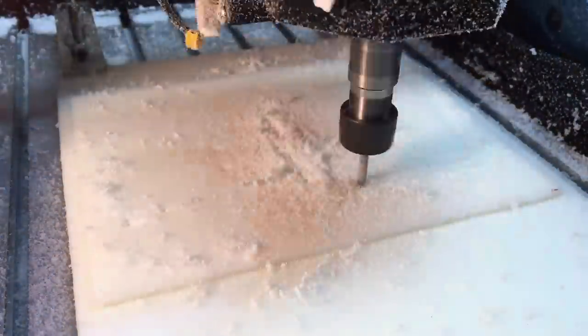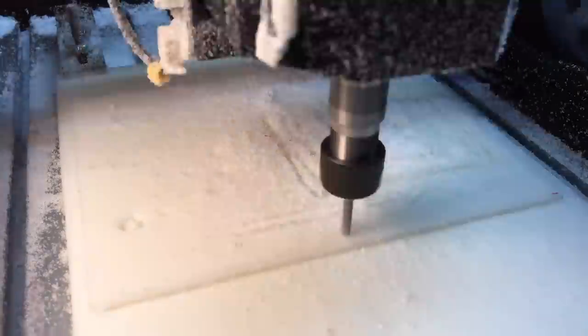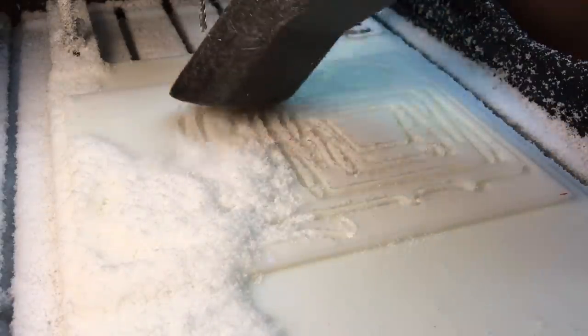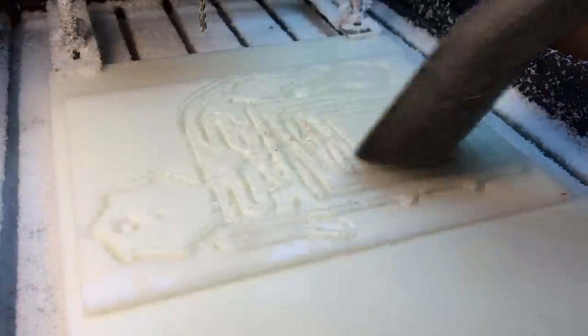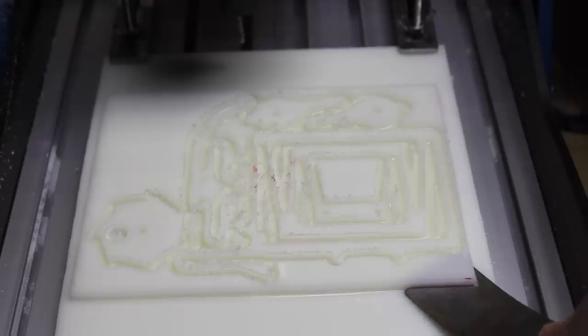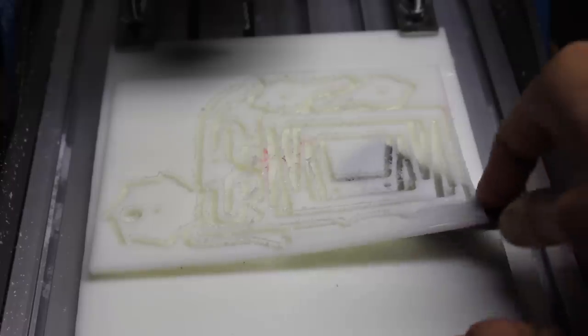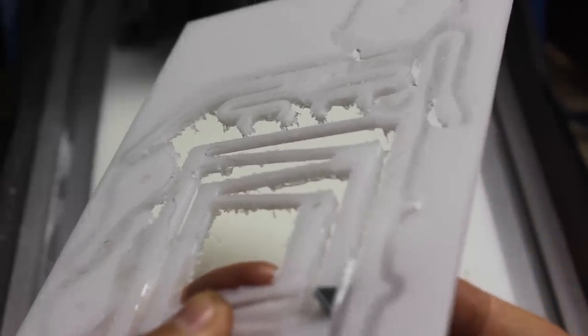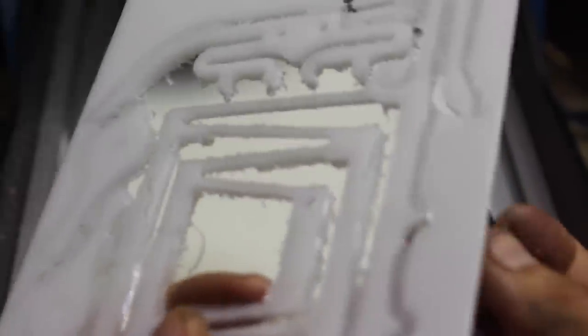You can't really leave it unattended because of how the chips build up. With such a small end mill, there's a good chance for the flutes to clog and the bit to break. It's not great that I let all these chips pile up, but that's the only way to film this dramatic vacuum reveal. I didn't intentionally leave a thin web of plastic, but in the end it made it easier to remove all these spindly parts without damage. This is the world's blurriest clip barely showing how a super sharp razor blade is great for deburring plastic parts.